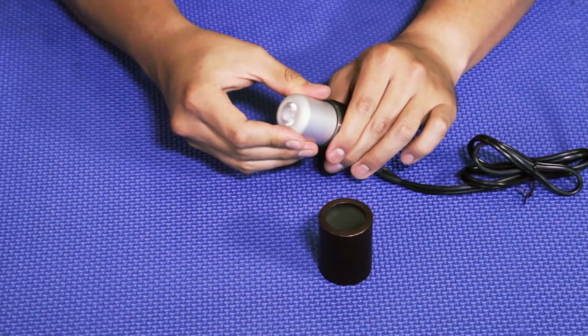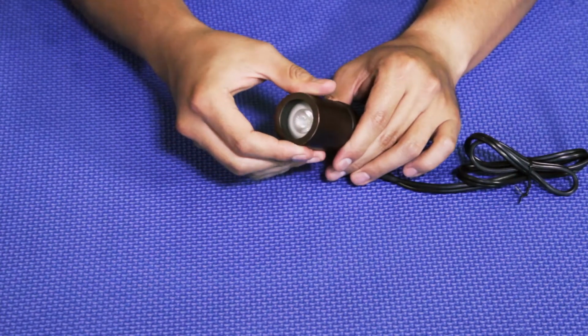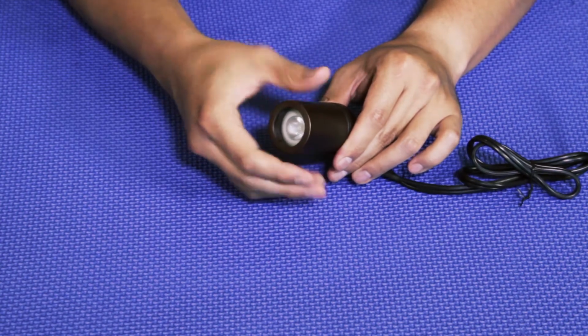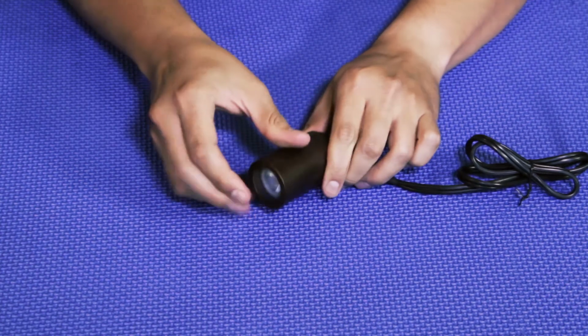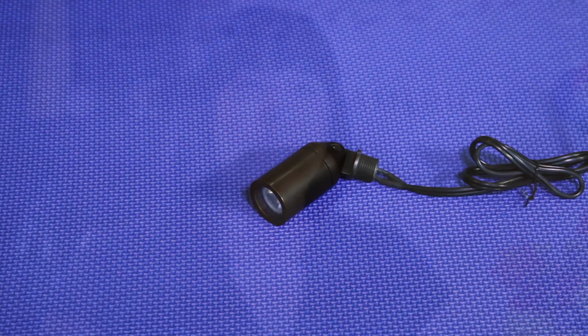We know that there may be some tolerance to the fixture size, so we recommend using thermal tape or thermal grease to bridge this gap. Of course, not all fixtures are sized the same, so we're able to tweak the LPH overall diameter to suit your fixture, or provide a donut-style heatsink that would slide around the LPH body and serve as an intermediary heatsink between the plugs and the fixture.